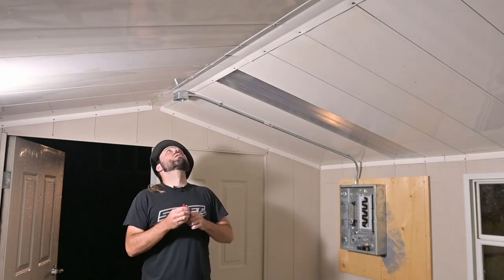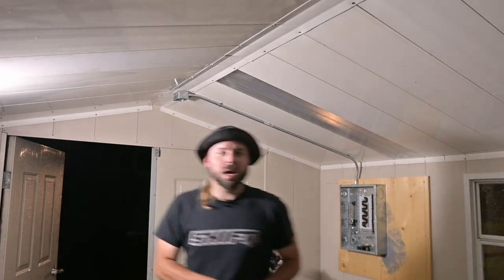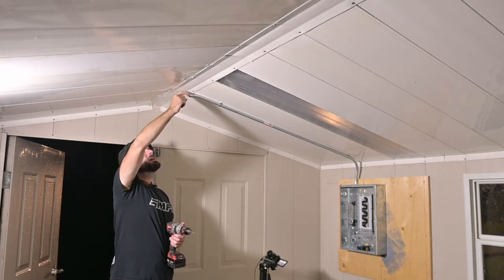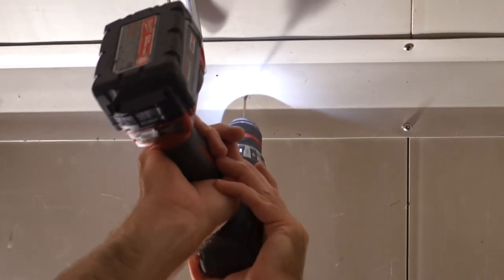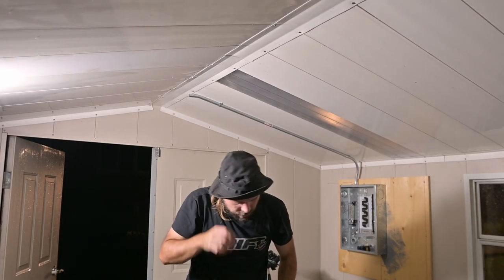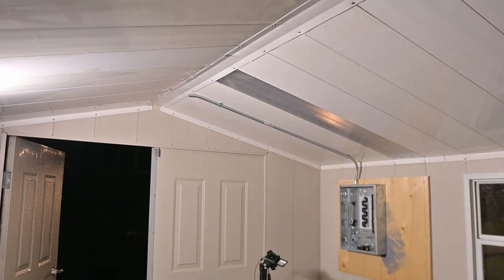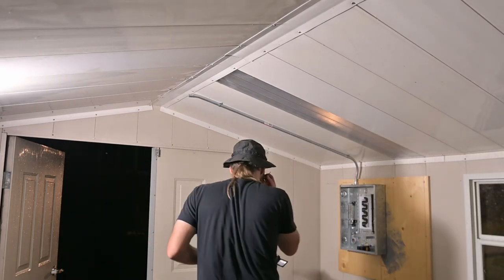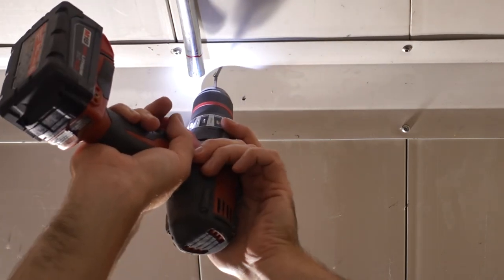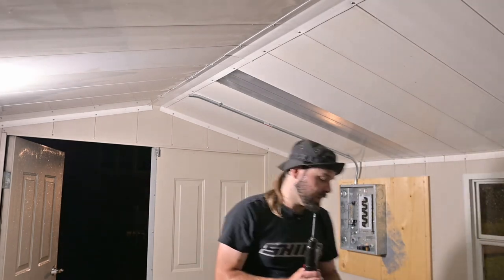Now I've got to do this other part of the plan where I mark a couple holes — one there and one there. There's something very specific happening in there now. I have to drill a hole up into that metal steel beam. I mustn't forget to chamfer and deburr this. Got to remember to do that to the other side too. Can I drill holes into this? It'll take some effort and I really should have safety goggles, but yes, I can. Now I need another one — there we go, that's two holes. Now you might be asking what are we going to do with these two holes? I'll tell you what we're going to do — we're going to tap them.